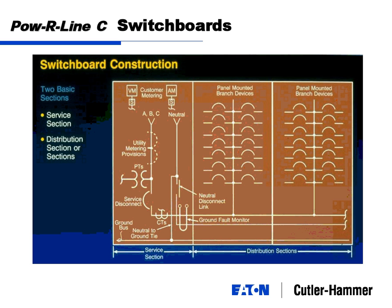And then this is your horizontal bus, which runs from structure to structure to structure. So on a switchboard, we can just keep bolting structures on as we're expanding. As many structures as you need all get spliced to this horizontal bus. Each horizontal bus then will have vertical bus that is built inside the structure. Vertical bus is similar to just a switchboard chassis, where you can then have all your branch devices mounted right on there.